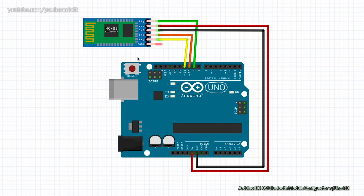We have the TXD and the RXD for sending and receiving messages and instructions between the Arduino board and the Bluetooth module. You need to allocate two digital ports for that purpose. At the top there's a pin called KEY. If you want to debug your module, you need to send a high signal to the KEY pin in order to put it into AT mode so you can configure it using the Arduino IDE.